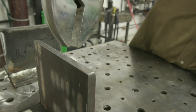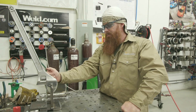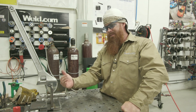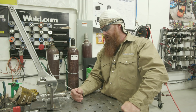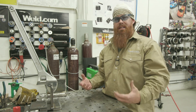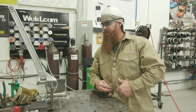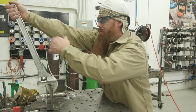Now we're back. We're going to show you exactly what this thing does. All I want to do is break this weld — it's meant to be broken. We're going to check the depth of fusion. If the plate doesn't break and just folds over on itself — which I doubt with 3/8 plate — that means it's an acceptable weld. If it breaks, it can still be an acceptable weld; we just need to check the depth of fusion. We'll be able to see that once we expose the root of the weld. Go ahead and apply the mechanical advantage and hopefully snap this thing open.